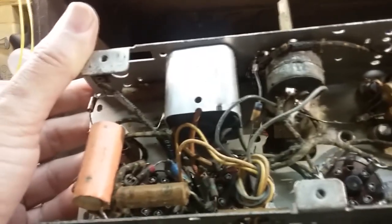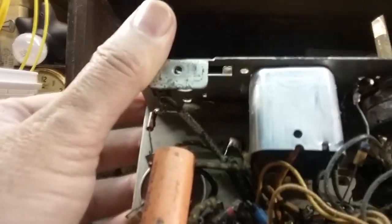And we don't have a lot of, turn it back the other way so I don't hurt that needle. We don't have a lot of capacitors to switch out. It's got 1, 2, 3, 4, 5, 6. I'm seeing 6 capacitors that gotta go and be replaced. That's probably another IF coil there, mounted underneath the case. That's interesting. It could be the antenna oscillator trimmer coil, but I mean, an antenna coil, yeah.